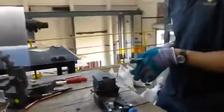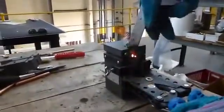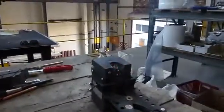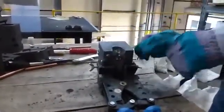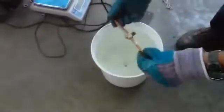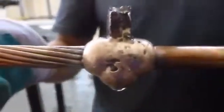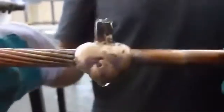Use the flint igniter against the edge of the mold — there we go. As you can see, it's a very quick reaction. With gloves on, you cannot touch the graphite mold — it's probably hundreds of degrees. Open it up, you can see it's still glowing red hot inside. You can either wait for it to cool on its own or take it as is — it doesn't need to be cooled in water. There you've got an exquisite join of bare copper earth wire to the 10mm round.